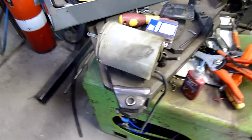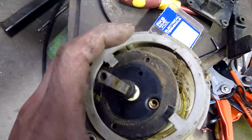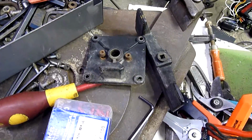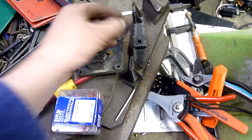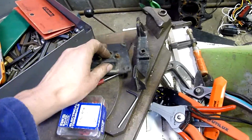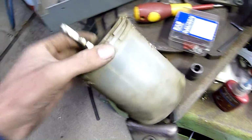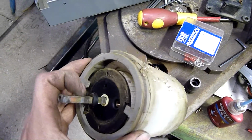Okay, so last step. I've got the drum switch out. It's a waterproof housing, somewhat waterproof. I guess you'd call it splash proof. The pedal came off easy enough. A grub screw and a bushing for the front of the pedal. I think it went like that. And the front housing. And yeah, I was able to pull the whole thing out as one unit. So yeah, it's just a big forward reverse drum switch.